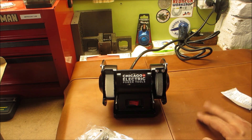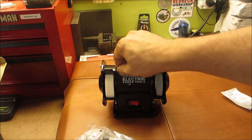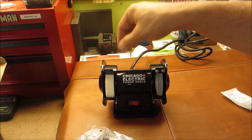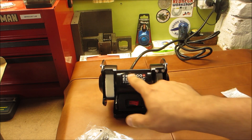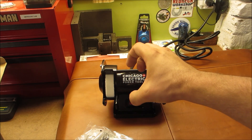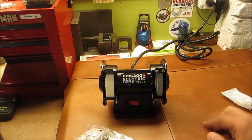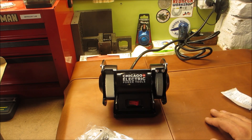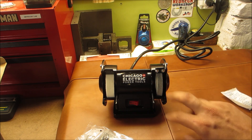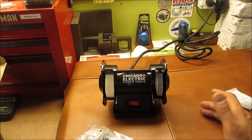That's okay for a rough cut, but not okay to do a finish cut. So I did some research and most people seem to use a brake-style dressing wheel, where the body would actually be a brake - so the faster you spin it, the more it clamps down, the more friction it provides, and it drags slightly along the edge. Those are a few hundred dollars. This is less than a tenth of the price and it's brand new, so I'm gonna give it a shot. I can always differentially spin this and be a little bit gentle. The stone style - I believe they're all aluminum oxide stones - so it's not a big deal.